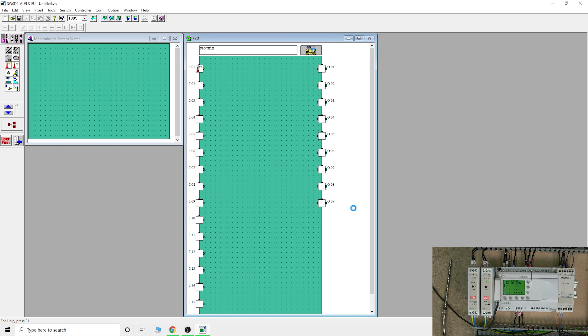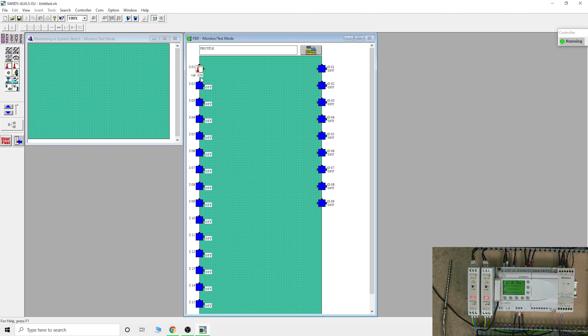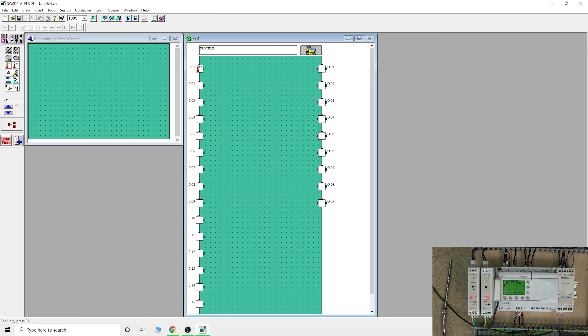We'll write and run the controller. As you can see, there's the value — that's what is going on in the temperature probe right now. I already adjusted my fine-tune and my workshop is 22 degrees, which is exactly what it is reading. All inputs that receive 0 to 10 volt signals will show some value as soon as you put a reading in. At the moment I'm reading 225, so that's 22 degrees Celsius.